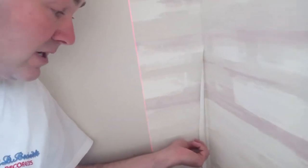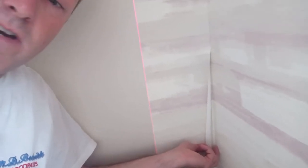Now I don't go through that with a blade, because what I don't want to do is cut through that top length of paper going through the paper that's underneath it. Past experience, when I was a kid, you think, oh, it's dead easy, just run a blade down it. Yeah, you can run a blade down it, but then what you end up doing is cutting through the paper that's underneath. Can you see that? It's only a fraction of an inch overlapping. You cut through that, and then when it dries out, it springs and the joint pulls away. So we don't want to do that. It's actually easier and neater. Just run a pencil up, all the way up, till it feathers out, and then cut it with your shears. So does that make more sense to everybody?